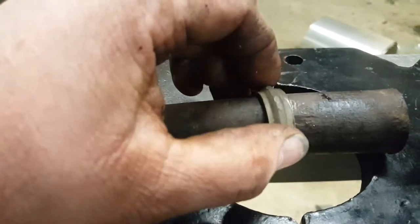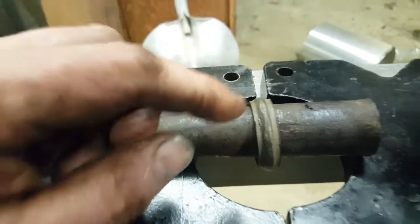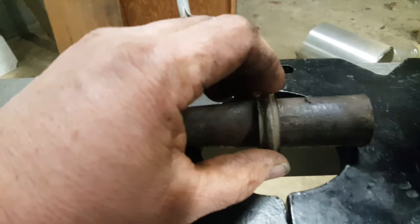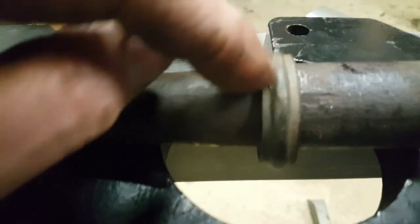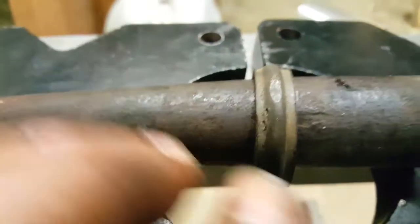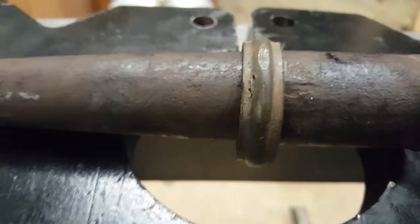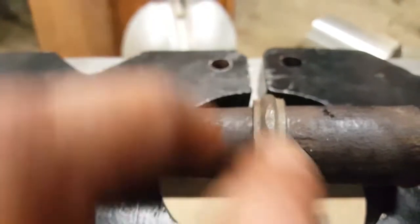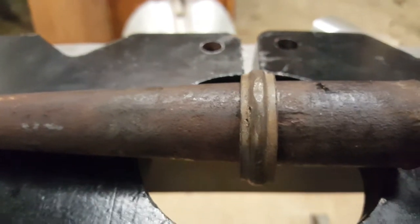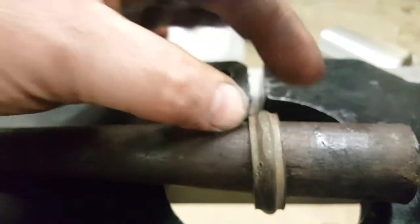If you do it there, then turn it and do it again — at least four equal sides: north, south, east, and west. You can do six sides if you want. Just push it down and flatten that right there out. As you can see, I've kind of already done that. When you flatten it out, it will spread slightly. Take your dial calipers and measure it — if you get it close to about 0.49, you should be in good shape.